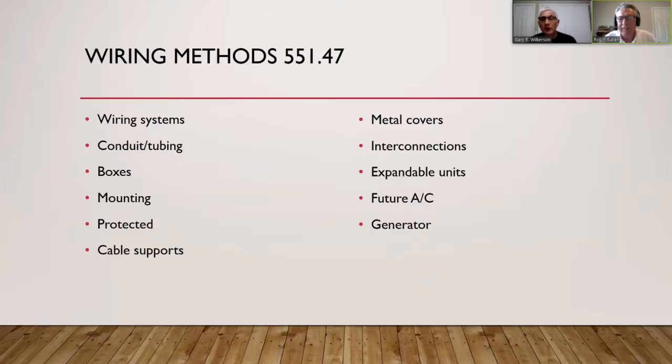When running conduit in outdoor locations, you also need connectors and couplings. Connectors are where the conduit terminates at a box; couplings join two 10-foot lengths together. Both must be rated for weather-type insulation. If you don't use rated fittings, you'll violate code. Conduit outside requires weather-rated fittings; conduit inside can use cheaper indoor-type fittings.